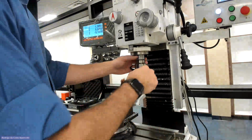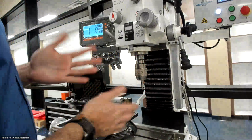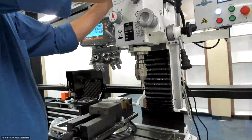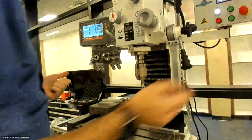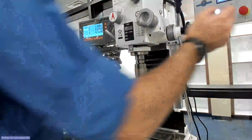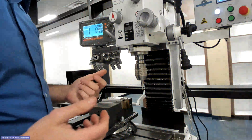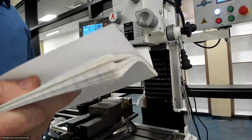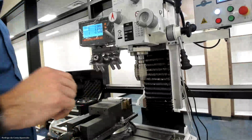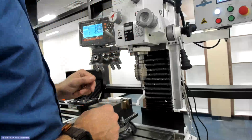Right. So then I can get my C wrench. I get it a little tighter there. Alrighty, I'm gonna close the drawbar chamber here, right? And we already talked about this, so I can actually go forward. Actually, let me go high, right? And I think the speed that I calculated on the other video was about 1500 RPMs. So 1500 would be H2. So H2.